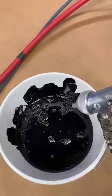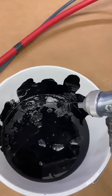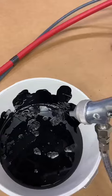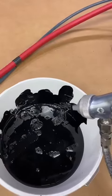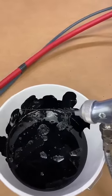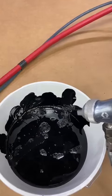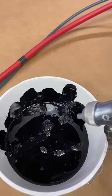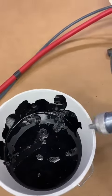The effect of that is you're going to see a flow rate change at the gun. As we come into that pump changeover, all of a sudden the flow rate coming out of the gun starts dropping way off and then comes back. So you're getting a really inconsistent flow rate, which is going to result in a really inconsistent fluid pattern.